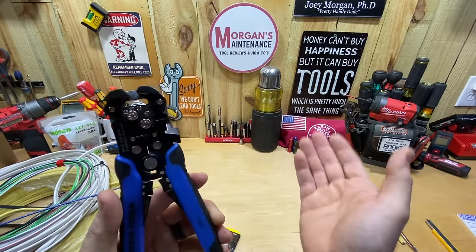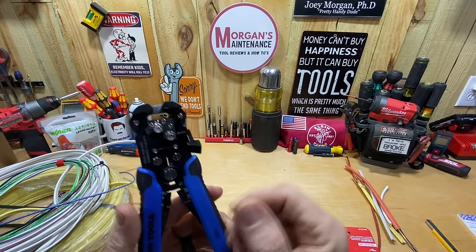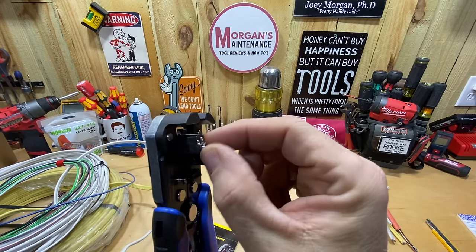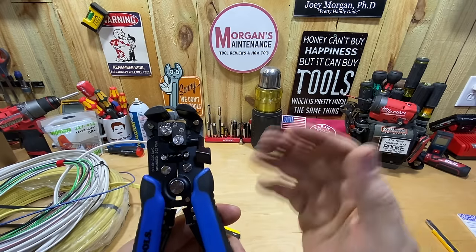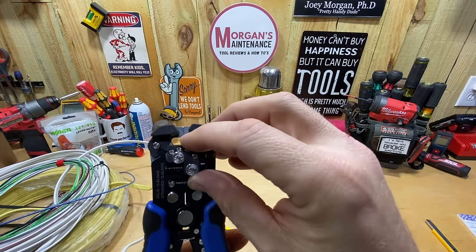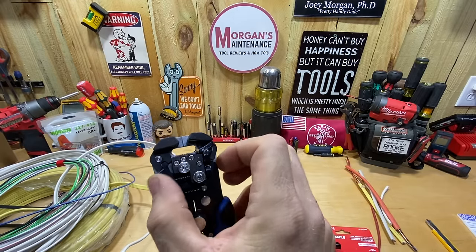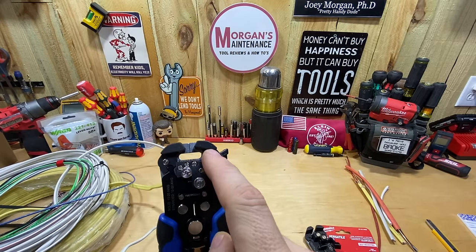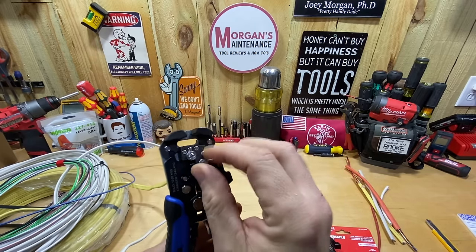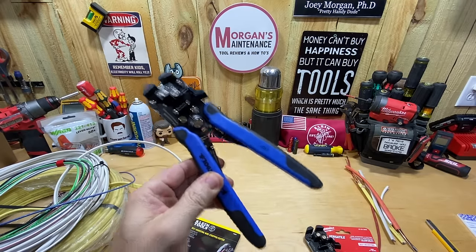For anyone watching just for the Klein who hasn't seen my Milwaukee video: you have this cutter, you can strip the wires I'm about to show. It's self-adjusting so you don't have to do much except maybe adjust the tension with this knob — minus or plus — if transitioning between very different gauge wires. You also have this stop block for repeatable strips, which you can adjust by loosening the knob, setting the stop to where you want, then tightening it down. Or move it out of the way entirely to strip more sheathing.